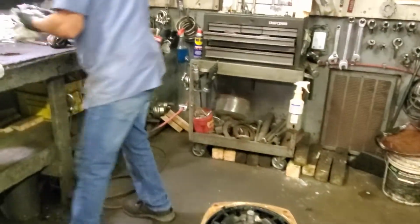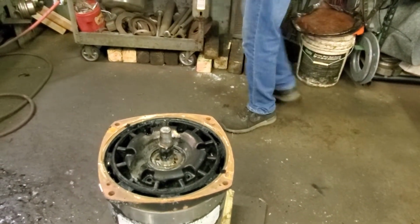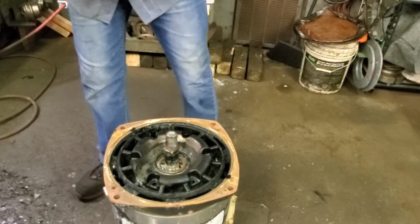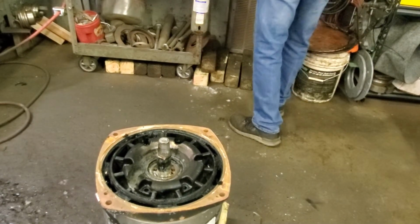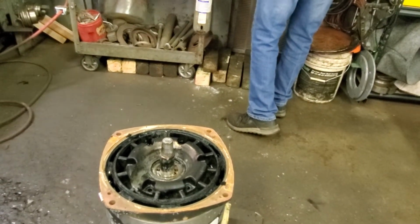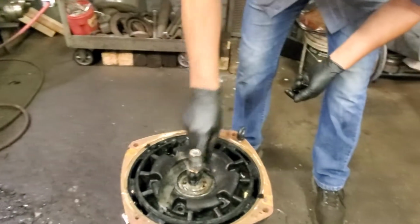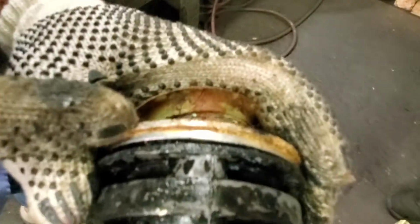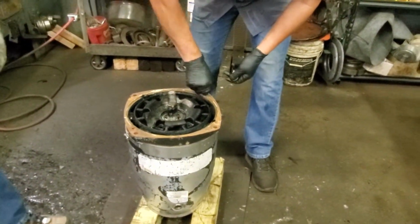But look at the seal right here. That's the ground. And I don't see an O-ring in here. The orange one? So there's no O-ring in that seal. Right, there's no O-ring. They have no O-ring at all. You see, both of you have the O-ring right here. See that O-ring there? The top part is okay, you see the O-ring definitely here. But no O-ring there. That's why the water was coming in like crazy.